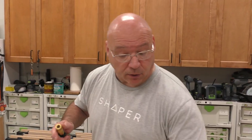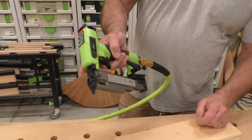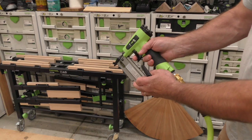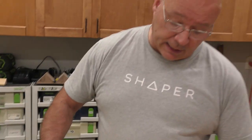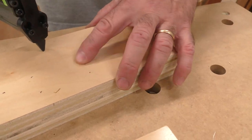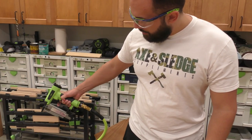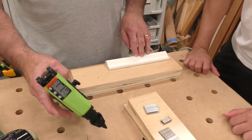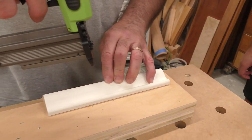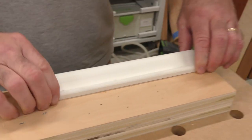Here's where the micro pinner shines. Now you have to be careful — do you see the safety on here? It's a dual trigger. You have to pull this back to load it, and always wear safety glasses with this one. That is actually great holding power. One of the greatest applications for this micro pinner is think about all the molding we've set over the years in the homes we've had. Right in this little reveal here — I can shoot into it and get very little filling to do afterwards, and the holding power is fantastic.